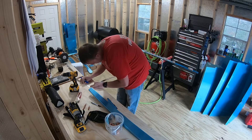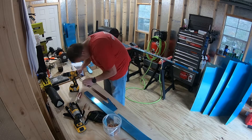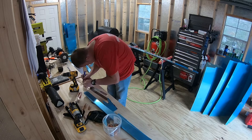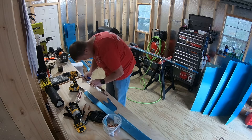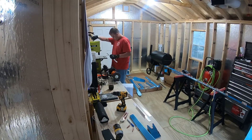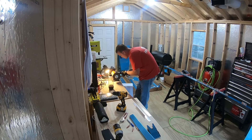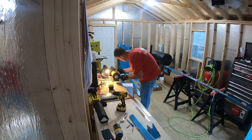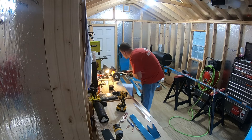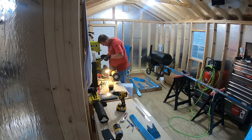You were supposed to drill all those holes out that were inside that doubler through the spar and that reinforced aluminum angle. Here I'm measuring out the aluminum angle to cut it down. You can definitely get by cutting this aluminum angle and those spar doublers using an angle grinder, but I prefer to get better precision with the bandsaw. I'm just using the regular stock blade on it, but I'm going to put an aluminum cutting blade on it shortly — that way the cuts are a little cleaner and leave fewer burrs.